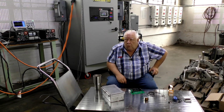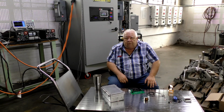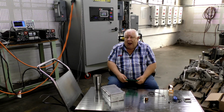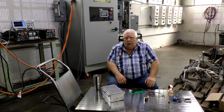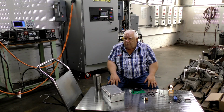The volt amps, or apparent power, times the power factor from 0 to 100% would give you your true power, or your active power, in watts. And that's caused by reactance. And there are two types of reactance: capacitive reactance and inductive reactance. Capacitive reactance would be if you were driving a switching power supply like a charger. It has a large input capacitor in it, and that is going to make the power factor altered.